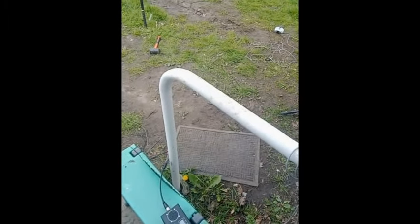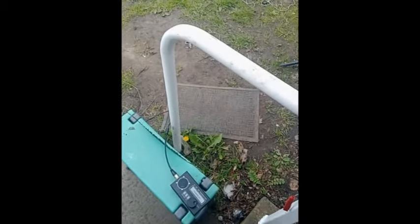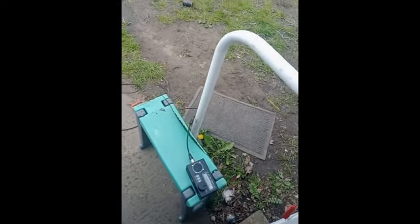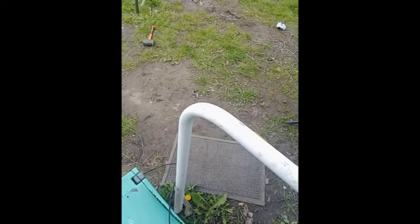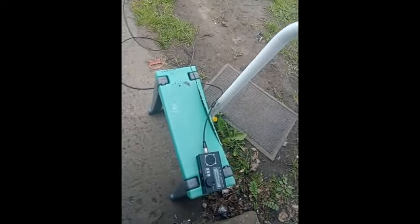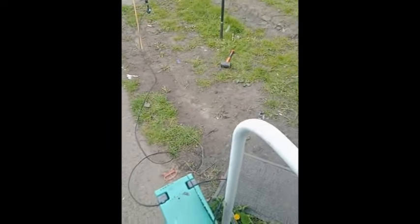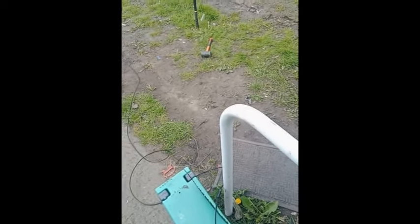That's like a three-metre lead — I've got a choke right at the base. You're not supposed to do that because you need some of the cable to act as a counterpoise, but it's only three metres and I don't want a three-metre counterpoise — it's going to cause what's called common mode. I've started making chokes. If you've got a double-ended patch lead, I've got these beads on it: one is okay, two is better, three is okay, and seven is best. I put six or seven on there and I like to put that end into the antenna.